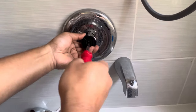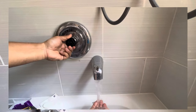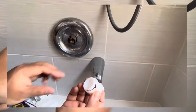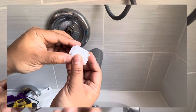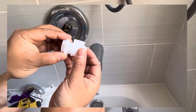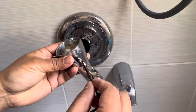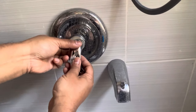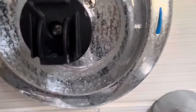You see those two tabs — they can stay separate or you can have them on top of each other, whatever works for you, but don't force it. It's plastic, so once you have it in place, make sure it goes in and doesn't stick out. Another important thing: be careful with your shower drain. Make sure it's closed or covered so that if a screw or tool falls from your hand it doesn't end up in the drain — that would be a bigger problem.